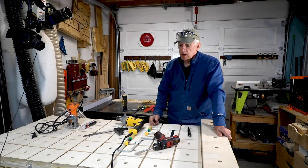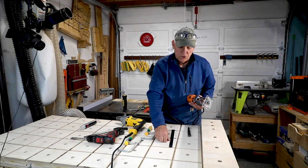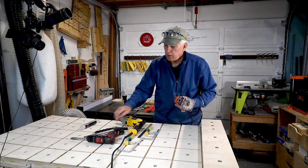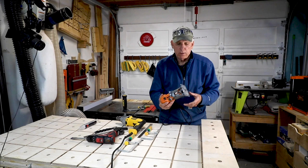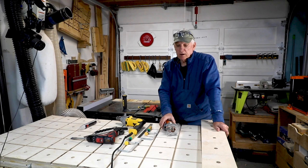The only other thing I do, just a personal preference, is I don't like to leave these all sharp edges. I like to do a little round over on them, a little chamfer. And so I use a 1/16th in my little palm router here. So I use a 1/16th round over bit. Test the depth of your cut on your practice jig and then go do all of your holes.